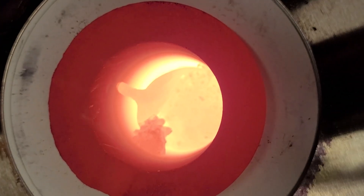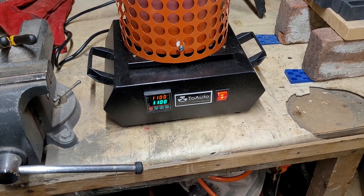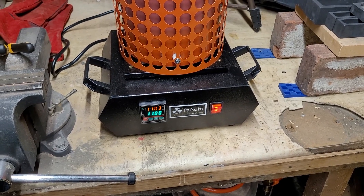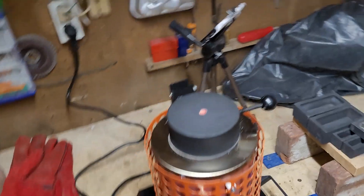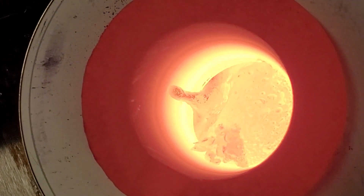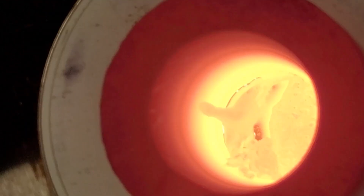You can hear it bubbling, so currently it's melting the metal — awesome! Going to wait a couple of minutes and then add some more copper. Almost 50 minutes into the melt — 49 minutes and 30 seconds to be exact — and we've reached the desired temperature. You can hear the clicks from the thermostat; it will keep around this temperature, a little bit up or a little bit down, but we're well over the melting point of copper. Everything has been melted — it's getting pretty liquid. Going to add a little bit of metal in a couple of minutes.